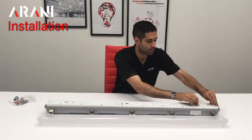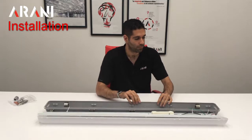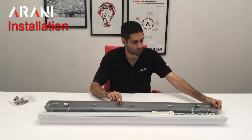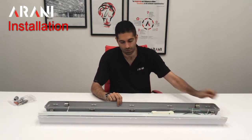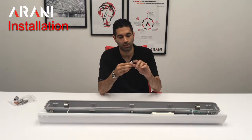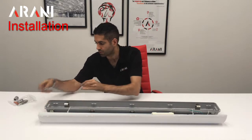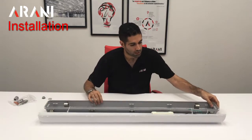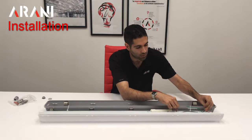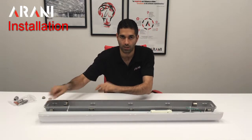The same on the other side — press the two together and pull on the handle. Now we can access the compartment for the wiring. The cable conduit would be coming in either from the knockouts on the side, or we can punch knockouts at the back. The driver has two wires that come out and they are fairly long, approximately eight to ten inches, so it's easy to access from either side of the fixture.